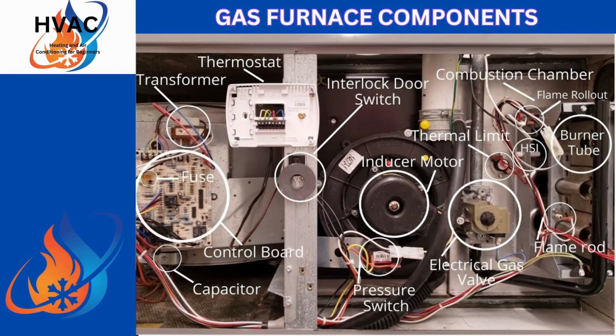But, learning how your gas furnace works, the best thing you could do is sit there and listen to what it does. If you're mechanically inclined and you're safe, you can actually pull the door off and hold in the door switch and watch everything work in sequence, and you'll get a better understanding of how that works. Don't be putting your hands near the burners. Don't put your hands near the flames. They will burn you.